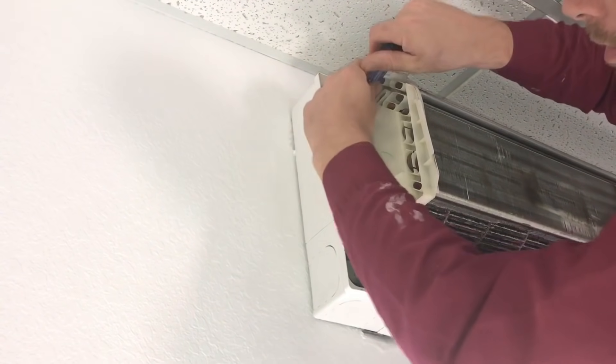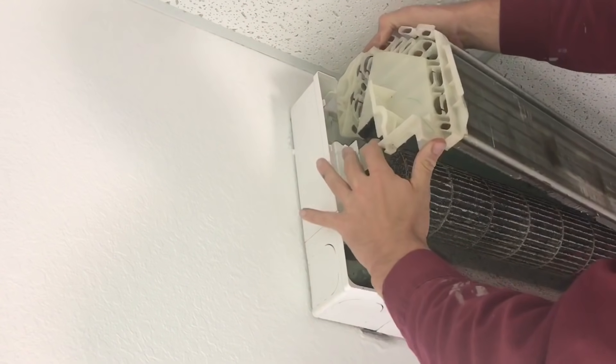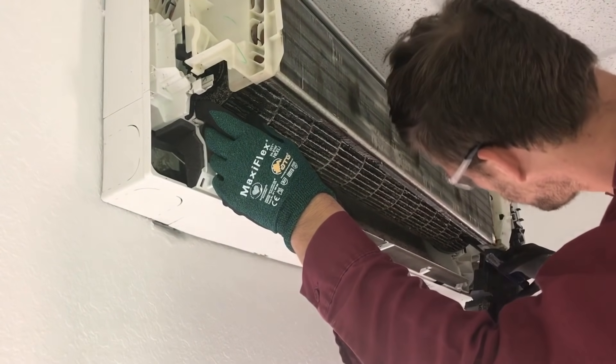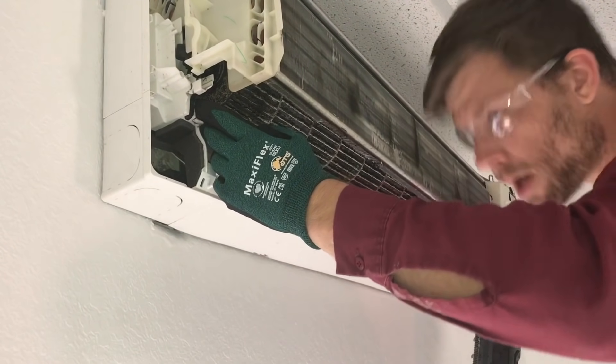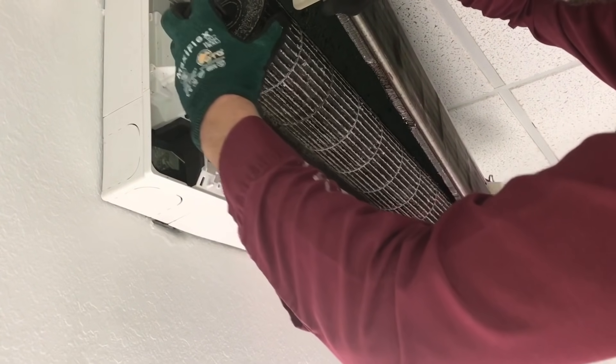Next I'll look at the back of that coil — I'm going to take three more screws out and pull the coil out from on top of the blower wheel. If you look underneath this coil, this is why I'm taking it off — look how filthy it is. The blower wheel has been spitting onto this coil and coating it, so I've got to get that cleaned off. The wheel is easier to clean if I take it out. There's a Phillips head down here between the motor shaft — you just unscrew that, loosen the set screw enough that it can pull out, then open your coil just enough to get the blower loose and it pulls right off the motor shaft.